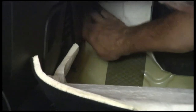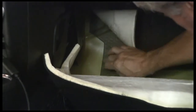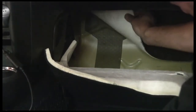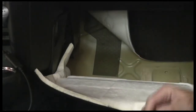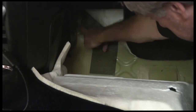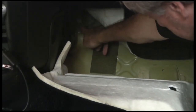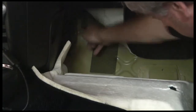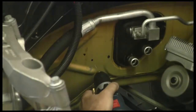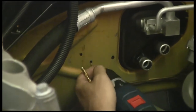I'm going to lift this up out of the way. This is where our screws are going to be coming through later. We want to check all our clearance — we've got our heater core over there as well. We've just moved this out of the way and exposed under the footwell. Our other holes are going to come through over here, one about here and one about here — about a half inch up and over from where we marked the little X on the other side. We've marked everything.